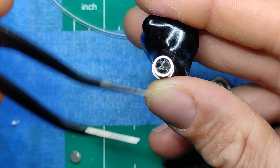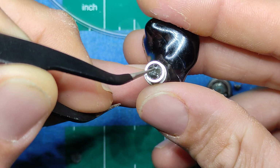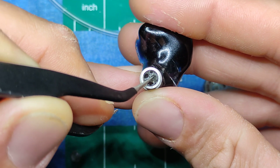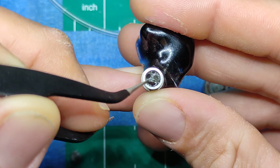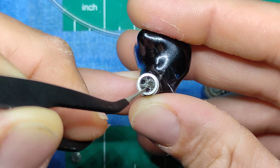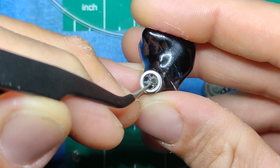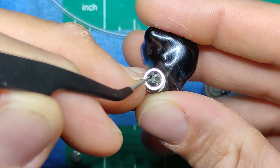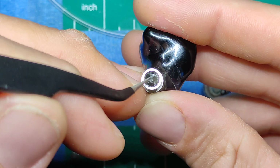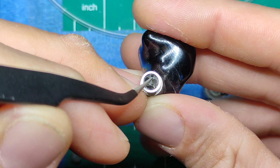But anyway, all the bass comes out of this little itty bitty hole right there. So that's where the bass comes from. And then you have your two sets of mid BAs, because there's 2 per side, 4 altogether. So you have your Sonions, all your mids come out of these 2 holes here. And then you have your treble, which comes out of this squished bottom hole here. It almost looks like a face, like a face with a third eye. So treble, mids come out of these 2, and then all the bass comes out of that little bitty hole up there.